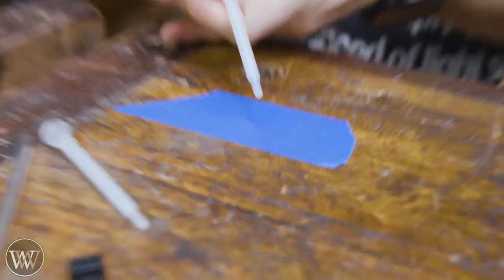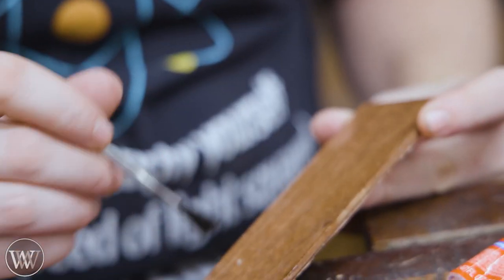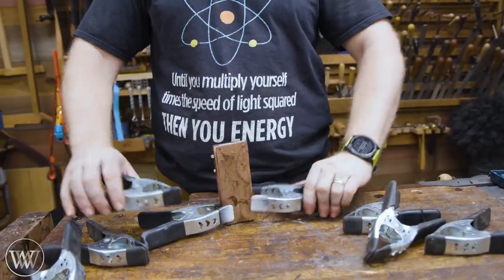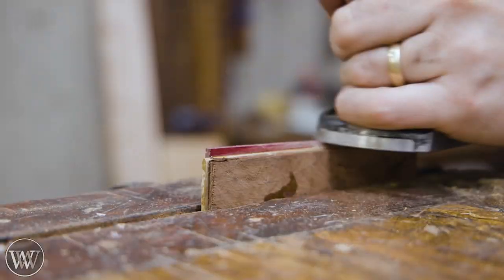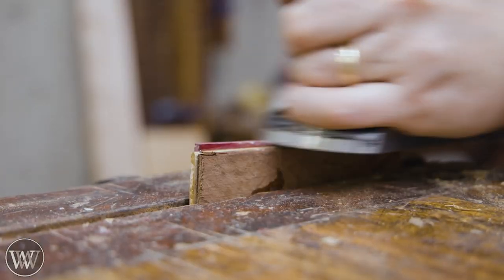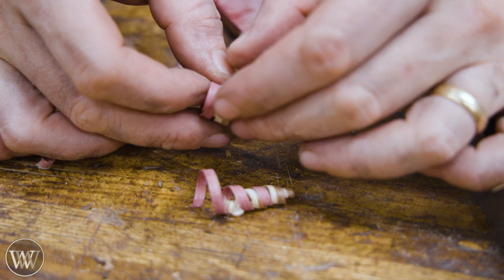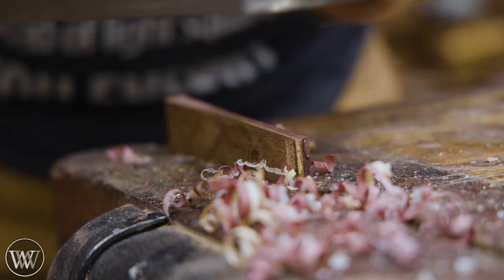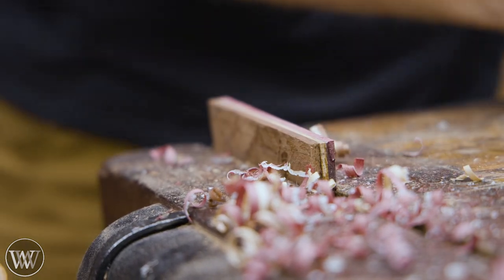I've got that thin piece taken down to about a sixteenth of an inch, and then these two outside pieces are a little thicker. I'm going to apply some epoxy, clamp it down, and then I've got this blob of schmoo with three different colors on it. I want to shape that down and smooth out all the sides. The two sides are pretty easy because I can just plane those down. I did make sure when I laminated them together that the grain was going the same direction — that makes everything so much easier. And because I was just doing these three pieces, I could take the time and make sure that they were.